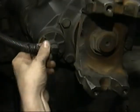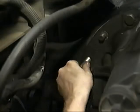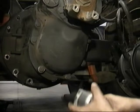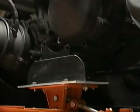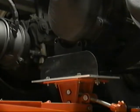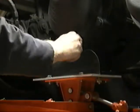To begin the forward rear carrier removal, disconnect the IAD shift cylinder air line. Install carrier guide pins at the 9:30 and 4 o'clock positions of the housing mounting holes. Remove two power divider cap screws — these are at the 5:30 and 7 o'clock positions. Move the adapter plate into the proper position. Some vehicles may sit lower than others; if the adapter plate will not line up, it may be necessary to jack up the truck and put it on stands.